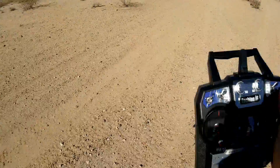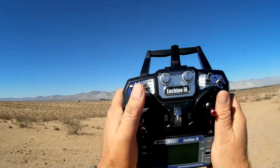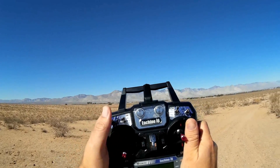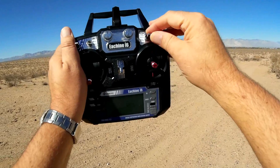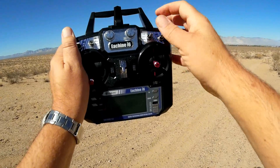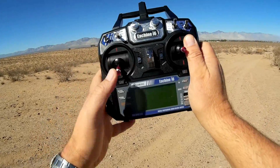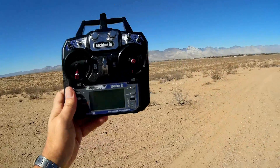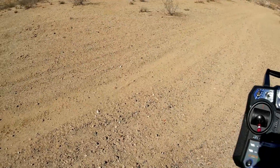Let's go over the flight controls for this particular tilt rotor. I went into CleanFlight and looked at the setup. It comes in angle mode, which you activate with that switch, and acro mode right there. This other switch is also active in CleanFlight — it's your throttle hold switch. You turn off throttle hold by putting it in center position, and turn it on either up or full down. To start the motors, you bring it down and to the right. I would not recommend anybody fiddle around with the CleanFlight settings on this right now, because they are tuned for this to be a tilt rotor.